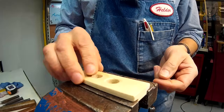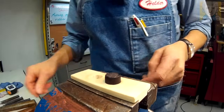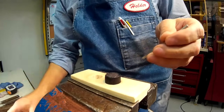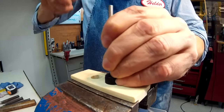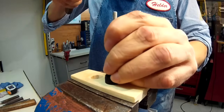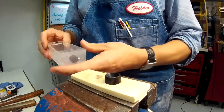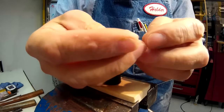So now I put the plastic insert and with this little punch — it could be anything, could be a nail, just the tip needs to be flattened — and now with a hammer and this little container I put underneath to catch that little ball. It's out. I'll take the rubber too, but for that I need a bigger punch. There's the little piece of rubber and the small ball bearing, and it has a little bit of rust.